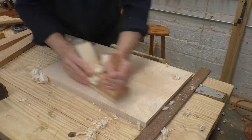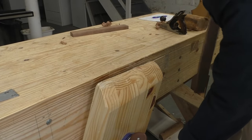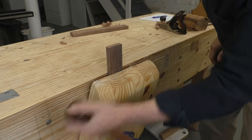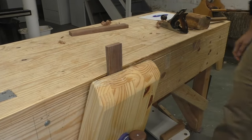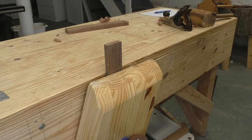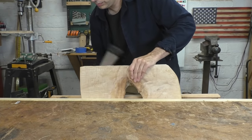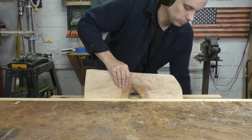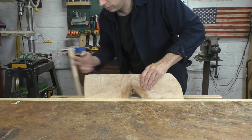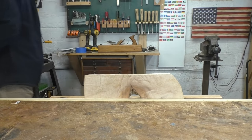If you're working on the end of a board, cheap, shop-made vises can actually be better than commercial vises because they don't have those guide bars. This is my homemade DIY leg vise, and it's angled to make it easy to grip pieces vertically and work on the ends. You could also build a traditional twin-screw vise. It's just a pair of screws and a board. This type of vise is optimized for dovetailing the ends of wide boards and doing cabinetry. It's much better than a cast iron face vise for that kind of operation.